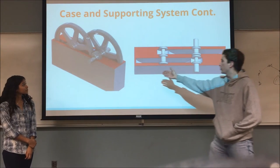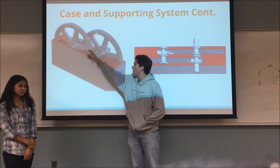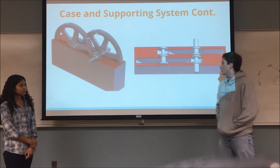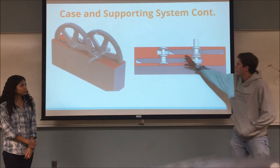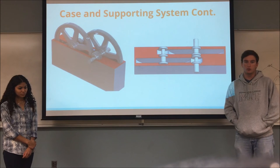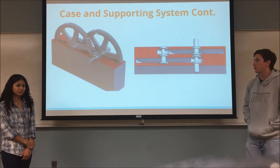In our render, a cut view of our casing shows the internals: the input pinion and input shaft couple to the first reduction stage with the first gear, which is fixed to the coupling shaft that attaches to the second pinion, leading to the second gear reduction and the output gear. With the gears removed, you can see how the first shaft, coupling shaft, and output shaft line up, with all bearings pressed fit into the casing. Empty space on each side allows routing of coolant or lubricant channels and mounting points. Since our gearbox operates in salt water on a boat, adequate lubrication is critical to protect the gears.